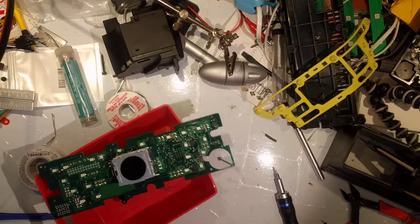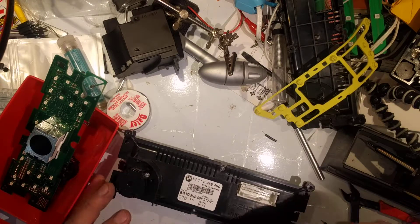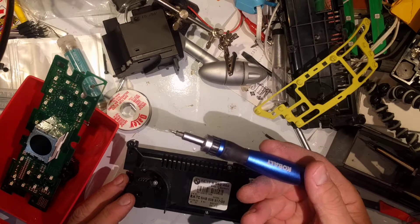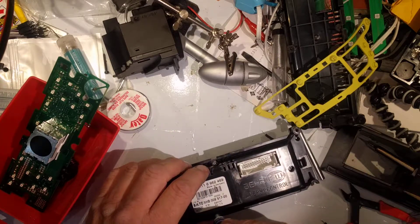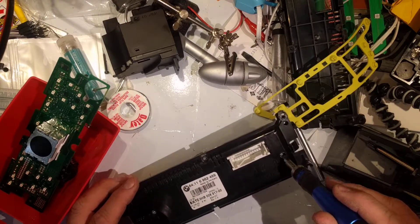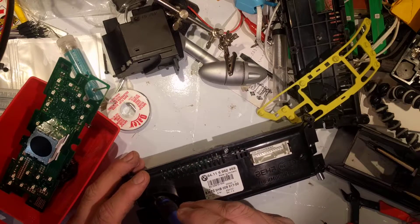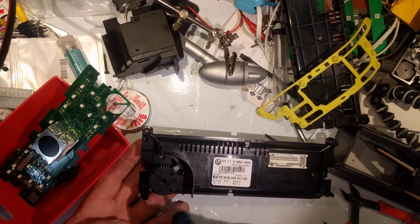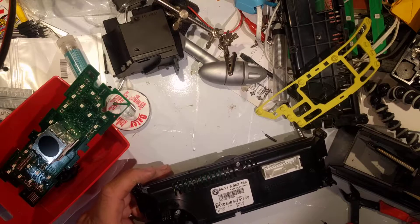That thing's got to do its cool-down cycle, so we're going to move this aside and take it apart. What you're going to need for this is a Torx T6 driver. I happen to be using this little ratcheting thing, but the ratchet's kind of useless after the first few tries. There's a screw here, one here, one here, one here, one here, and one here — and then it just comes apart.